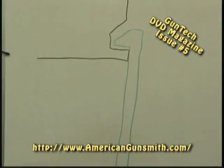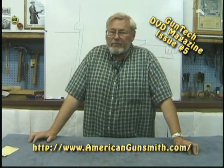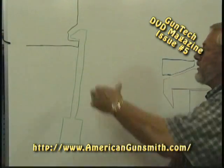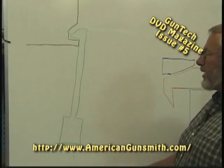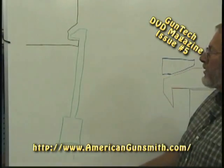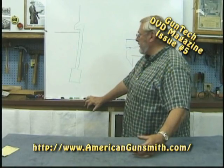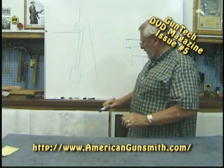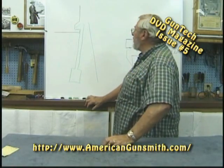Another system that we don't even think about — so subtle that most people aren't even aware of it, including some manufacturers — is the way John Browning designed the 45 automatic: the extractor fits in the slide at a slight angle. The green is the extractor and the black is the cartridge case. The cartridge case is straight up and down and the extractor angles to the right slightly. When the gun opens, the extractor wants to straighten up and put the weight all in line with the pivot point, so the hook wants to move to the left and get a better purchase on the rim of the case. Very subtle. Now if someone has drilled the hole off so the extractor sits differently, you're going to have trouble getting that gun to reliably extract — and the more weight you put out there, the worse it's going to get. On those, I would replace the slide.